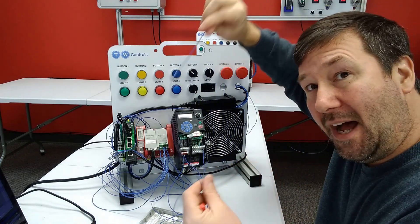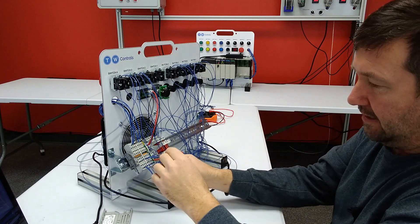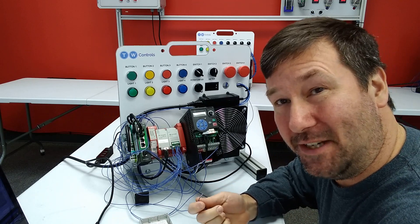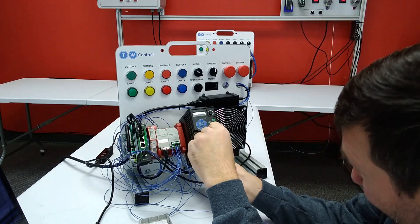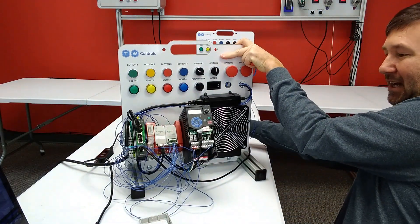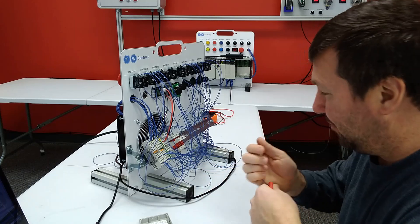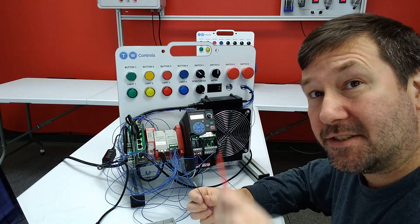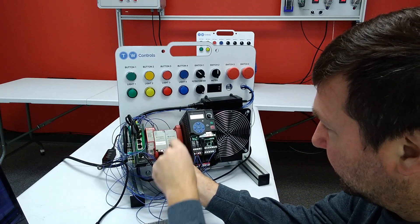I'm going to take the wire connected to S1 and connect it to terminal number 16 on our PLC. Then take the wire connected to S2 and connect it to terminal number 17 on our PLC. Now we're going to take a wire from terminal number 8 on our drive — actually this needs to go to the minus of our power supply, so that wire going to terminal number 8 needs to go to the right set of terminal blocks for our power supply. And we need a wire from R1 of our drive going to the plus of our power supply — the left set of terminals which is our plus 24 volt. Then we're going to connect a wire to R2 and it's going to connect to input 1 on our plug-in module — that's the top row, the second one.